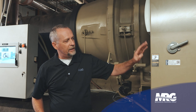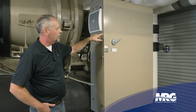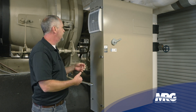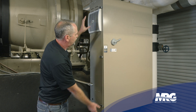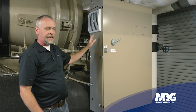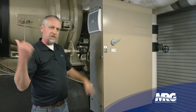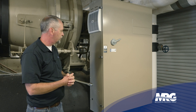Here's the starter cabinet we gutted — we put our drive right in here. The drive has a heat sink on the back, so we had to cut a hole in the back of the panel for it to hang out. Then there's a fan in there with air passing all the way across the drive to keep it cool. If you ever did have a VFD alarm or an overtemp, it would show on your front panel, the chiller would go down, and you'd be able to pull that up and see exactly what the alarm was.